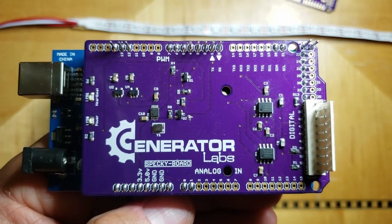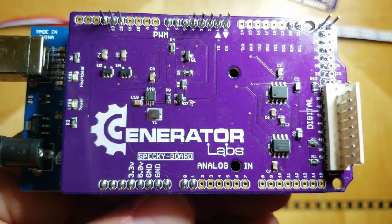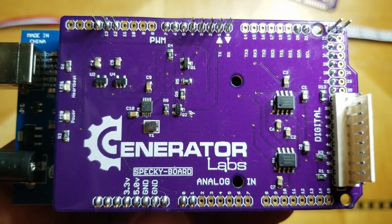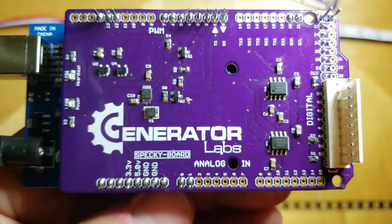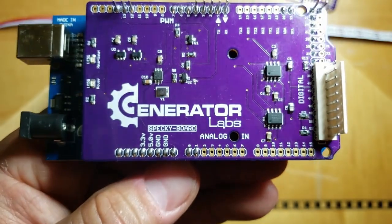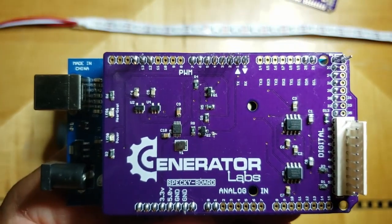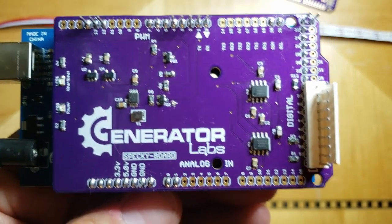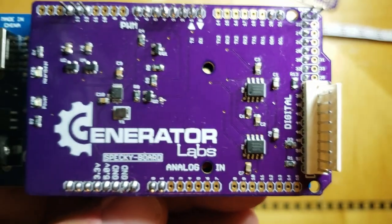And I have to use a stereo microscope to manually examine my solder connections after everything is said and done. And I use specialized gear to do the soldering, and just standard techniques that anybody would use with these small components. There are some special techniques that are used with hot air workstations and preheating this PCB in order to make things flow easy. But it's not as easy as one would think.